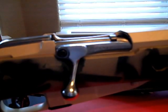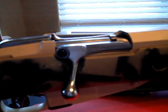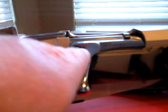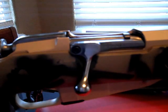So once you put it on there, you need that hex bolt and that hole to be pretty much perfect. So be real careful about that. Measure your hole exactly where you want it. Go ahead and take a little punch and make a little dent there so that your drill bit doesn't dance around. I didn't use a drill press. I never do when I tap and die.